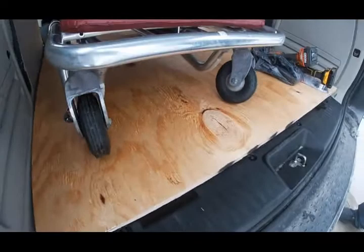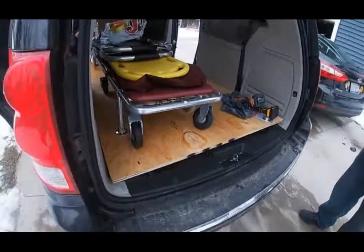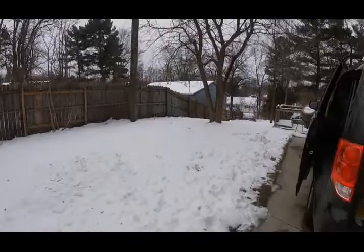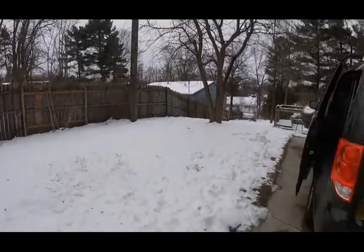And what did we learn about adhesive for linoleum flooring? For the glue to work, the glue and the wood has to be at 65 degrees or above for at least 48 hours before, during, and after installation. And as you can see by the snow and ice on the ground, that ain't going to happen unless we put it in our dining room — and that ain't going to happen either.